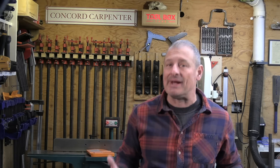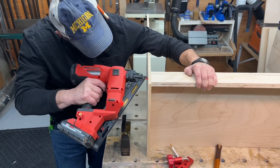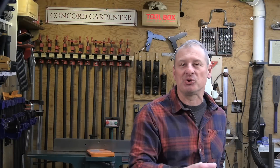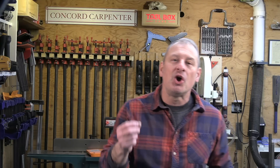The feedback on Gen 1 was that nail holes were too big. One interesting fact: the dynamic movement of the tool and the striker pin slipping off the nail head was causing those double marks. When Milwaukee actually filmed the nailer and slowed it way down, they discovered the striker would drive the nail and then slip off at the last second, creating a larger hole. To the naked eye, it looked like two distinct holes.